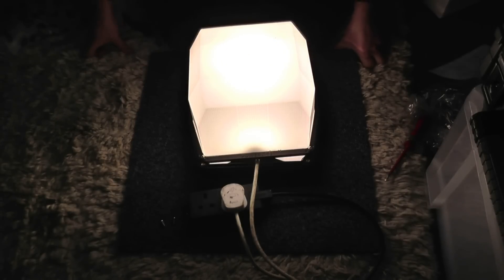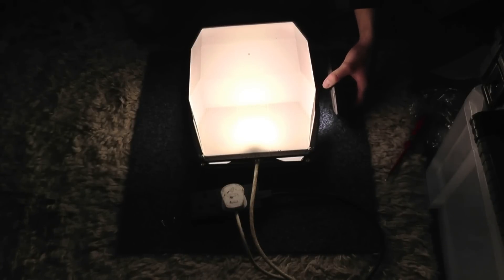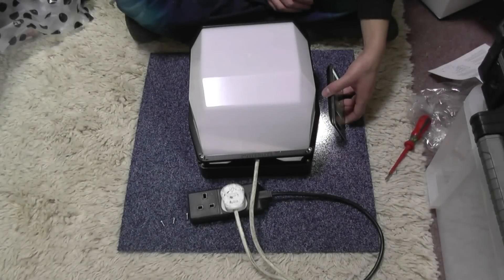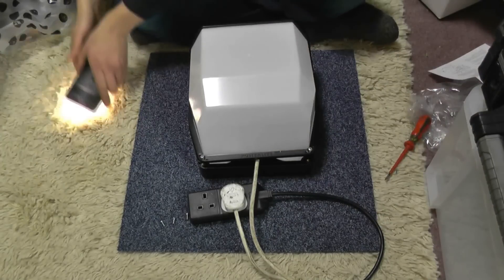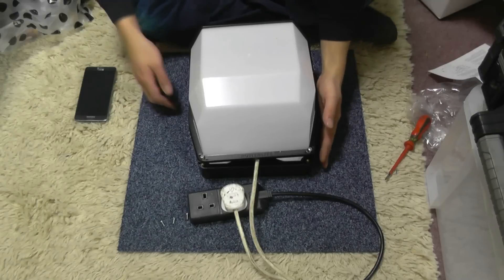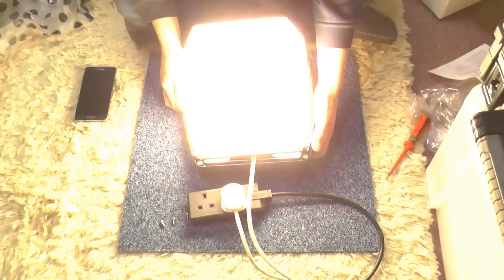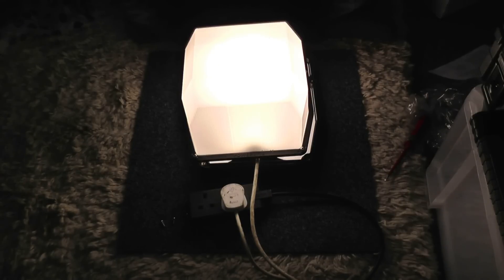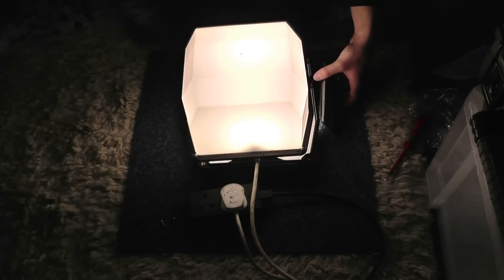What I'm going to do now is just wait for the photocell to warm up, hopefully, and I'll be back. There we go — I had to trick the photocell with my phone torch, because it's actually quite dark on this side of the fitting despite having lights above. I'll put that there, wait for it to come back on, cover it with my hand — there we go, back on — then speed it up by shining a torch into it, and off.